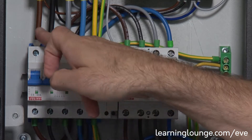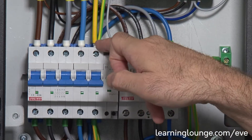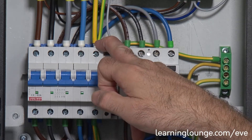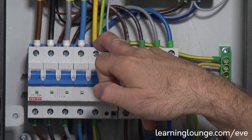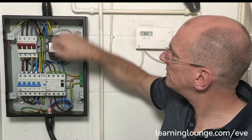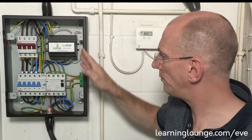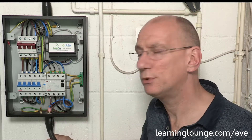It's very comprehensive — it disconnects phase 1, 2, 3, the neutral and the protective conductor, and that is essential for the safety within BS 7671 regulation 722. So basically you must ensure the protective conductor for the circuit does pass through here, because if you connect it through this part of the circuit, it will flow through to the EV charging point.